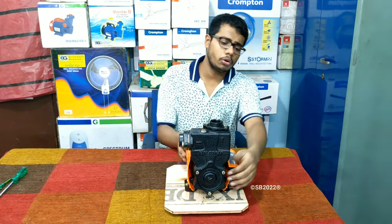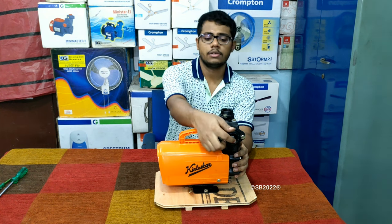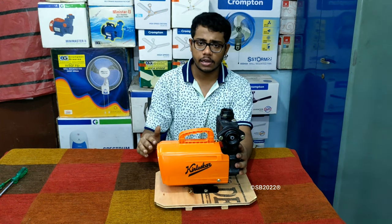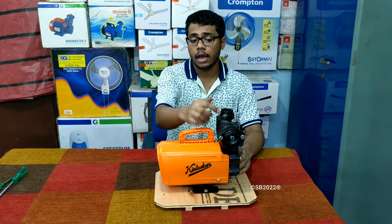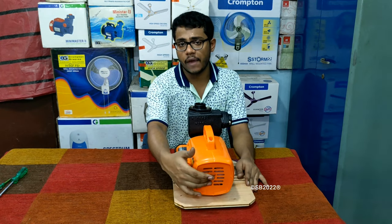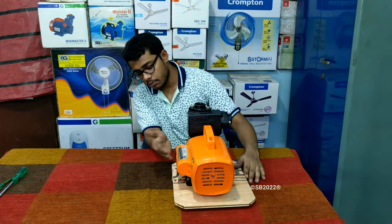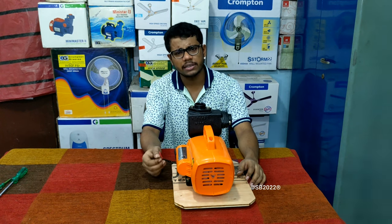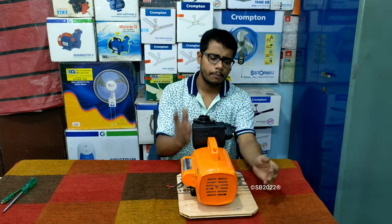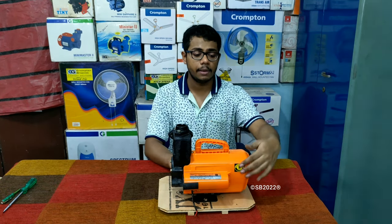This is the product. This is the suction side with the suction valve — the valve is good, it returns back when pressed. There is a rubber membrane since oil is currently filled in the pump; when connecting the plumbing I will need to cut the rubber part from this flange. This is the back side with the motor cooling fan. The power wire is quite small — the pump is gigantic but the power wire is small. This is the one negative aspect I noted. Overall I will say the pump is awesome. On the opposite side, the Kirloskar signature has been given.